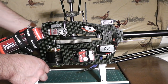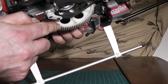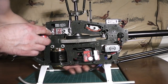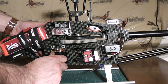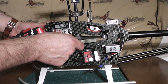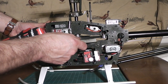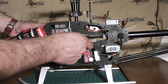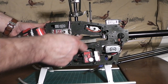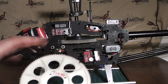Another important element to talk about here is: before you set your mesh, you've got to find the high spot on your main gear. What I've done here is I've marked the high spot the very first time I found it. What you want to do is push the motor back as far as it will go and rotate the main gear. You'll notice when you move forward and back you'll get a clicking sound and a sense of distance. As you go in it gets tighter at the high spot — really tight in there. Then as you get around, it starts to loosen up again. No main gear is created perfectly — every main gear that I've dealt with is made of Delrin and it's not machined perfectly.